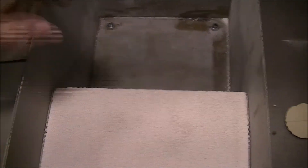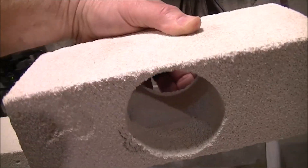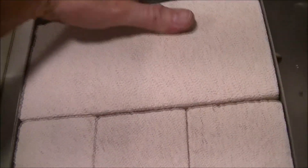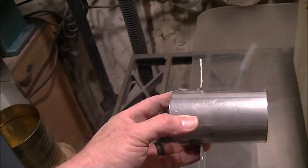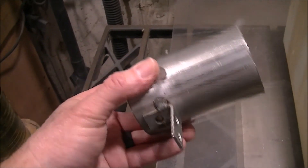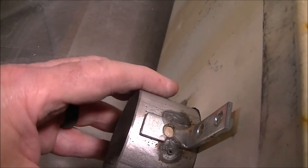We'll just stack these bricks in. Here's the brick for the chamber, and the heat source is going to go in from this side - it just slid right down. It makes a 13 and a half inch chamber, which is going to be good for the longer knives I make. I'll slide the back bricks in, being careful not to completely block it off since I may need a hole there for air circulation. I took a piece of exhaust pipe - just a tail pipe from the auto parts store - and welded a couple of little tangs on it, cut to just the right length so when I put it in, it sticks in and I can screw it down top and bottom.